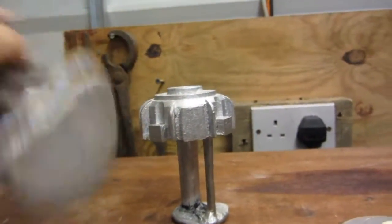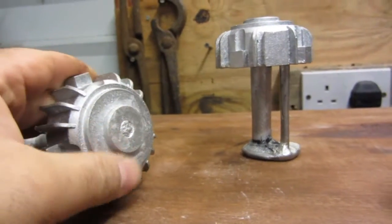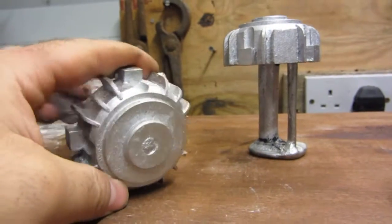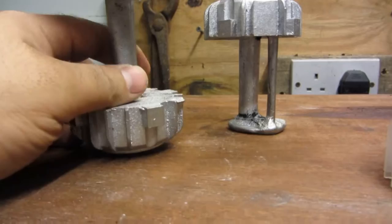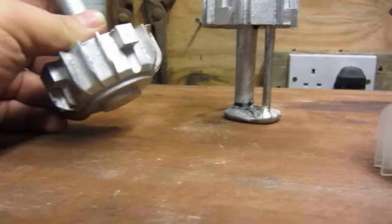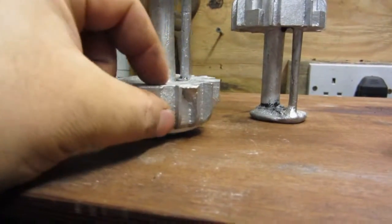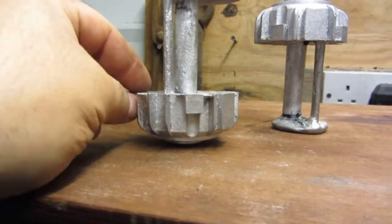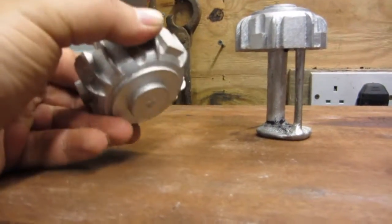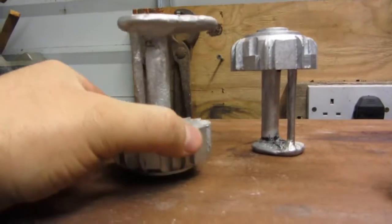So basically my adapter's made to go in the chuck of the lathe. I fix this in place using this boss part here. This center boss part is a locating area because that's dead central. It locates into a bore that's in the adapter, and 4 Allen screws come through the adapter and screw into holes in this casting which are tapped, to clamp this onto the adapter firmly.